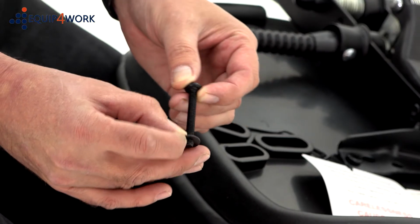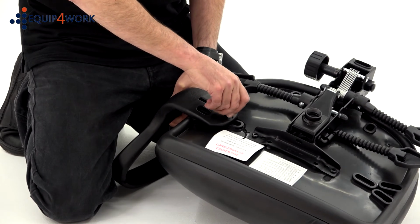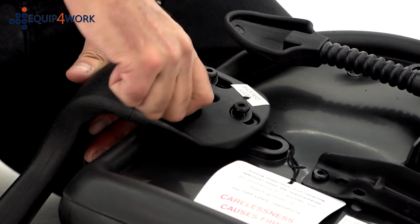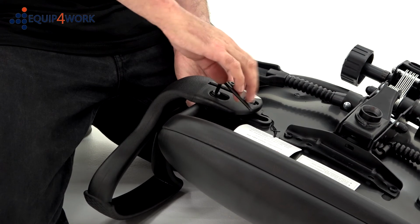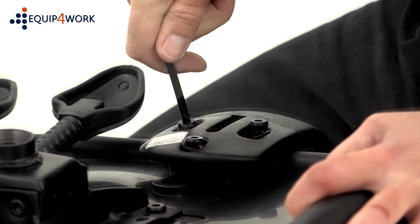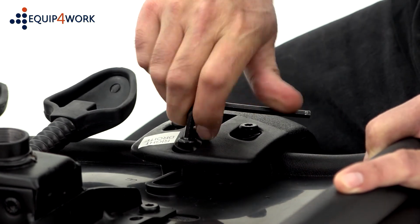Turn the seat pad face down and fix the arms into position using the 6 bolts and washers if supplied. If the arms are marked underneath with L or R to indicate left or right, make sure they go on the correct side of the seat pad. The longer bolts fit through the armholes nearest to the outside of the chair. The 2 shorter bolts fit through the remaining armholes into the base of the chair.